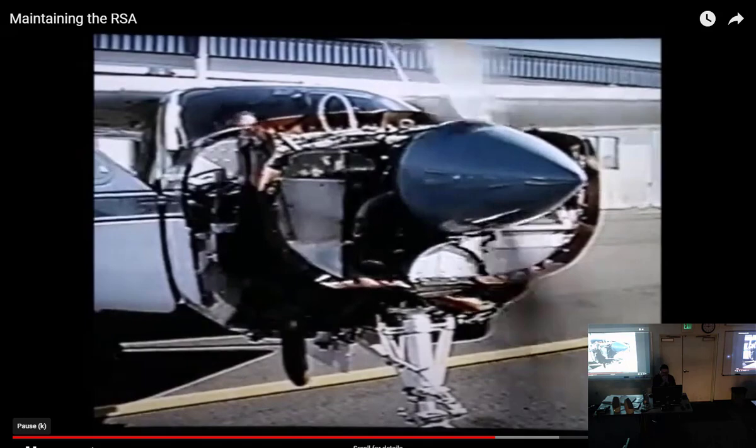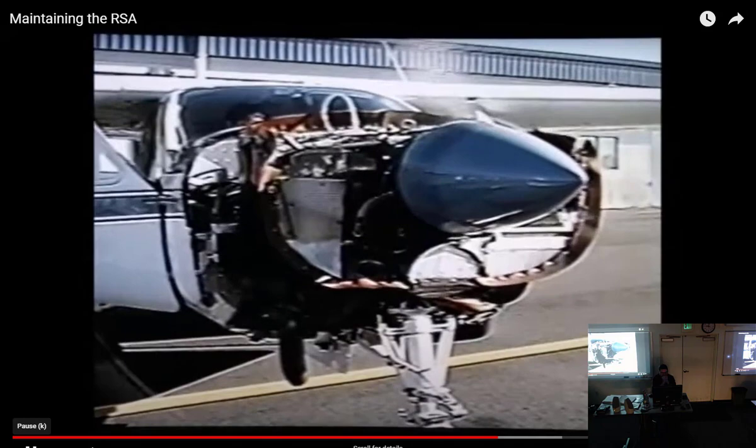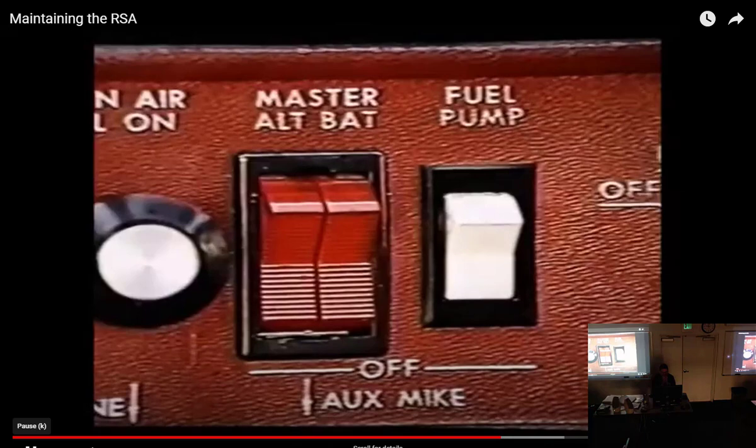If having the boost pump on improves operation, then a leaky fitting or hose is possible between the boost pump and the main fuel pump. A large air leak or boost pump shaft seal leak may not give improved operation with the boost pump on.